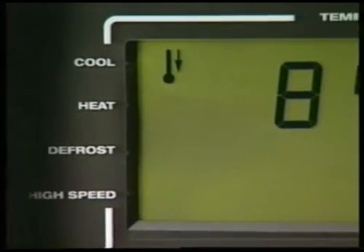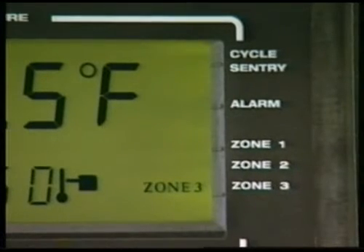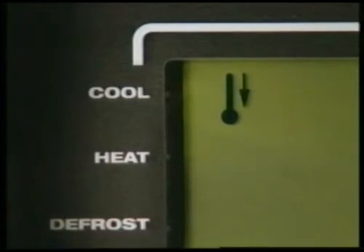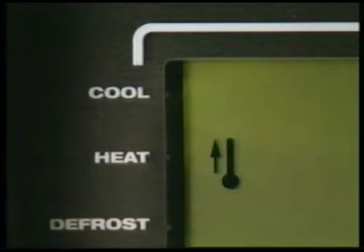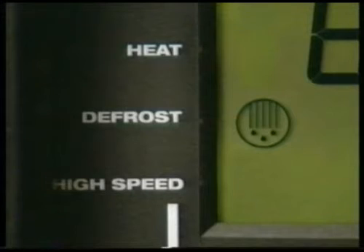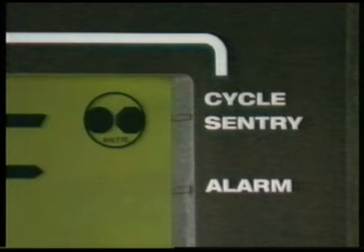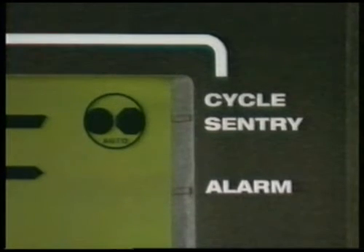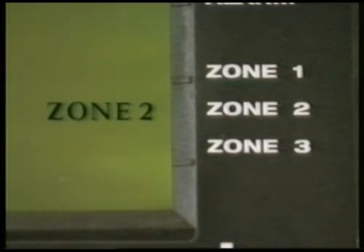The sides of the display show the system operating conditions or modes. Symbols or icons will appear on the display whenever an operating condition or mode is active. The cool icon will light when the zone being shown is cooling; the heat icon indicates the zone is heating; and when the defrost icon lights up, the zone is in defrost. The high speed icon means the unit's diesel engine will run in high speed unless other unit requirements prevent it. When the unit is in cycle sentry mode, this icon will light up. The alarm icon will be on or flashing whenever the microprocessor has detected an abnormal condition. The zone icons indicate which zone is currently shown on the display.